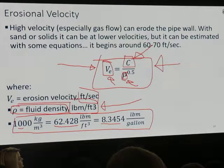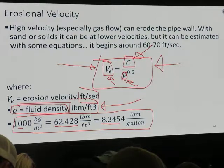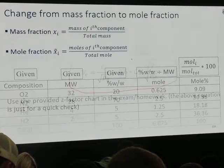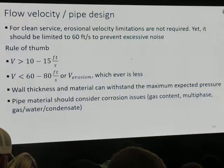If they don't do anything and just come up with, hey, use 500, don't believe it. Yes, question. It just depends on, so we have two values, right? If it's erosion or non-erosion. If it is very corrosive, it's 100. If it's not that much, use 300. The people before us already did the tests. They used a corrosive material. They used a material with solids. They used gas with more solids and they found out. They did some tests. That's how we believe it. They have seen it already and they just put it in a formula form. Okay, that is the erosional velocity.